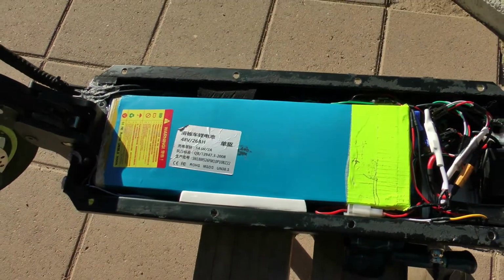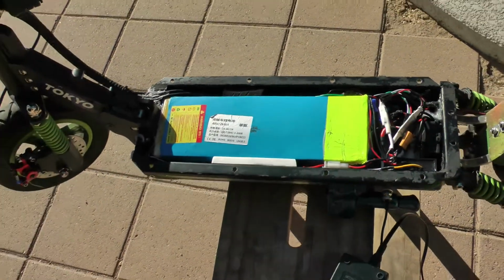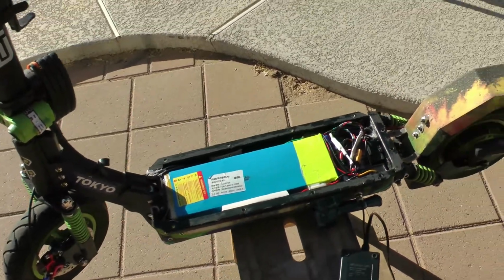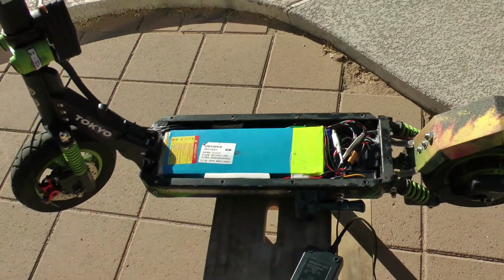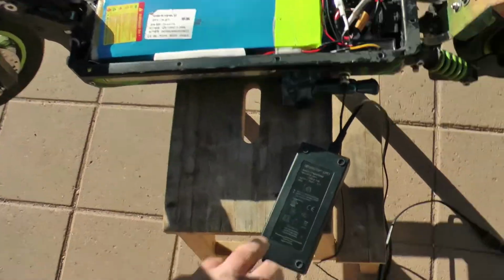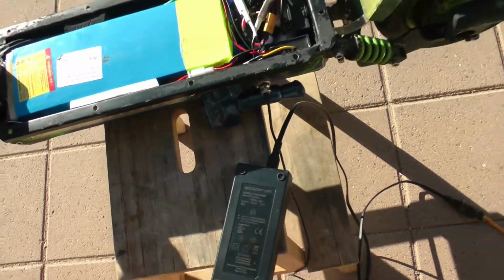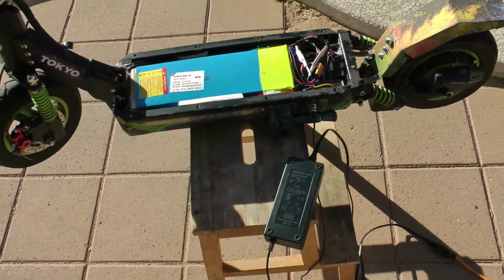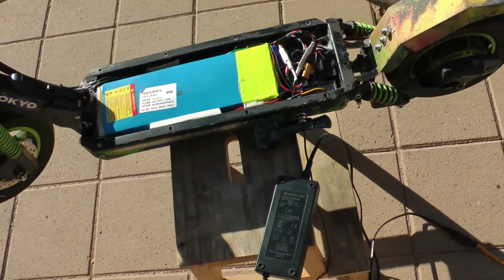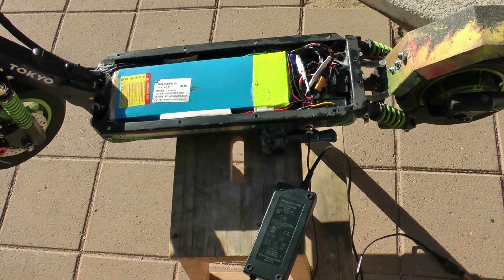The other thing is, generally speaking, from the research I've done with a LiPo battery pack such as this, you should keep it to 5 hours or more from fully drained to fully charged. So, for example, this one's going to take about 13 hours, 26 divided by 2. That's way over that 5 hour rule of thumb. The 4 amp one's going to take about 6.5 hours, still over that 5 hour rule of thumb. So it should be safe, should be good.